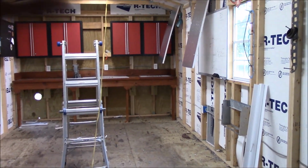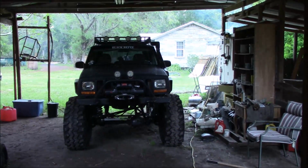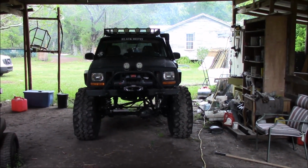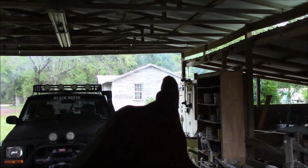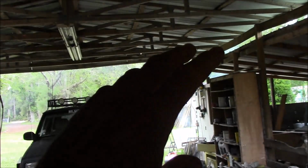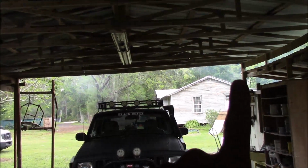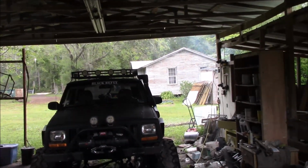Now, next weekend, we put all my stuff back in it. Then we get this formed up, pour a slab out there, and then start fixing the barn up. I'm going to pour the slab first so I can work off the concrete up to shore this thing up. But we're going to straighten up that doorway with a 12-foot 2 2x8s or a 6x6 or something on 2 poles there, and kind of fudge it to where it's straight instead of like that. And then when we do the outside, it'll look decent like that instead of jacking the whole building up.